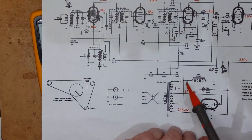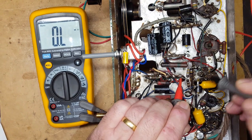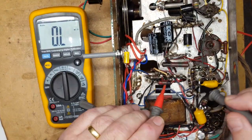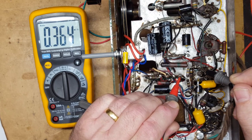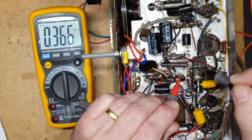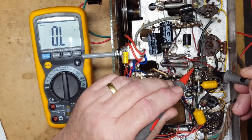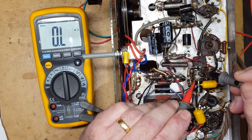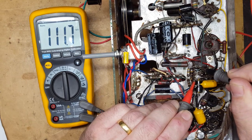According to the colors it should be a meg, so that's under half its value - that seems pretty unusual. The second resistor should be 470K; we've got yellow, violet, yellow so that's 470... and we're reading 365, so it's a bit low on what it should be. The third little one down here is supposed to be 100K, and we're getting 111K, so that's right - within 20 percent, we'll call it okay.